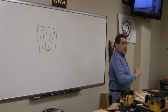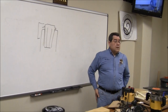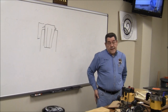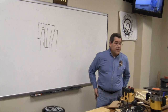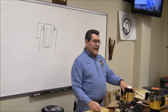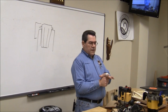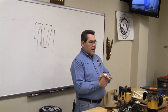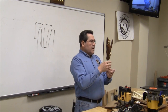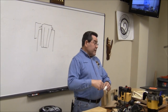There's another solution to the depth-of-cut question — you can get a shaper, or you can get a router that is designed to extend further. Most of these routers have the collet and nut come almost even with the base. But there are a couple of brands where that motor will actually come up and expose the nut and the collet, which means you can cut deeper and also easily get a wrench on it from the top instead of having to reach under your base plate.